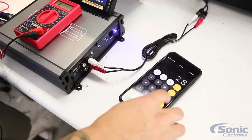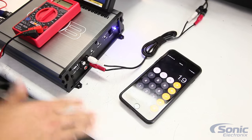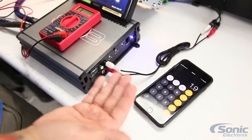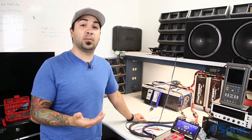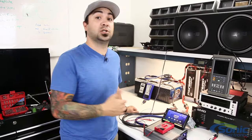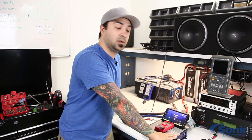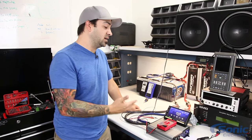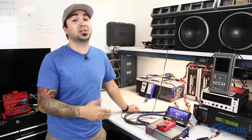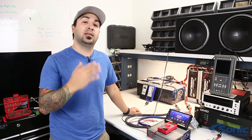So 2.8 minus 0.9 gives you 1.9 ohms. You'll typically find that on a 2-ohm woofer or speaker the range will be anywhere from 1.8 to about 2.2 ohms. What we really want to highlight is if you meter this and find it's actually 1 ohm — that is where the problem will be. This amplifier is 2 ohm stable, so if a 1 ohm or half ohm load is presented, it's more than likely going to go into protection or cut in and out. It's actually doing its job — protecting itself. It wasn't designed to play that impedance.